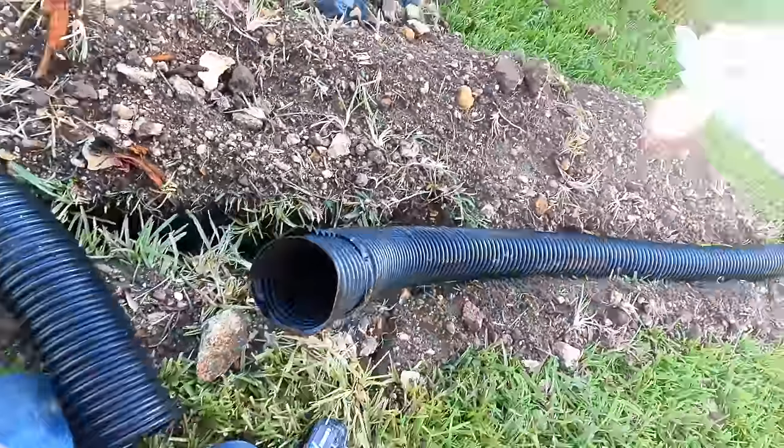Just during that heavy rainfall, this little section of French drain — gravel, perforated pipe, and the two catch basins — collected all that water. Tremendous amounts of water collected with four-inch pipe. It's all going to settle, there's still some cleanup, but wow, what a difference.